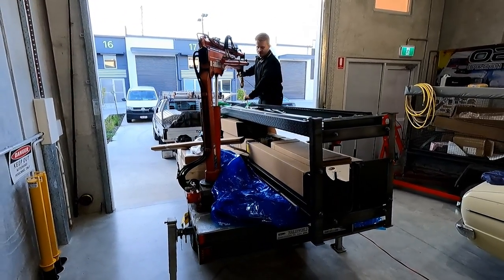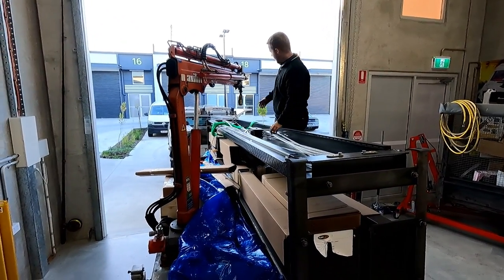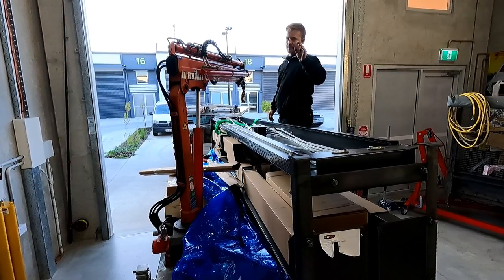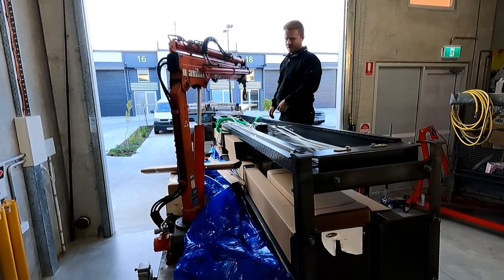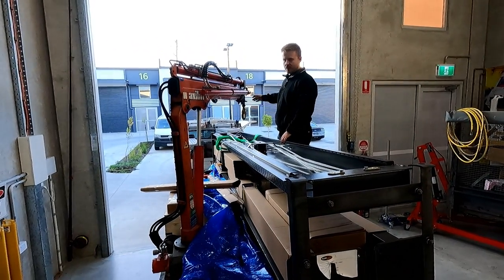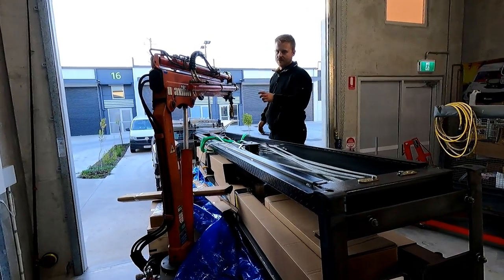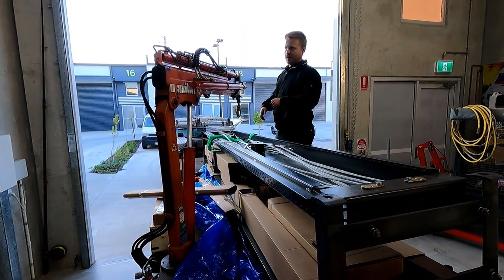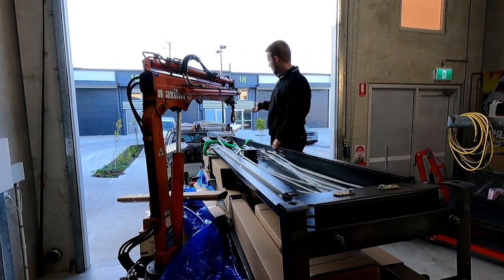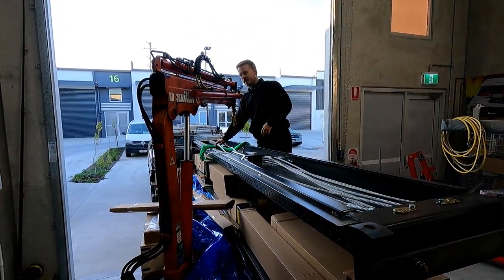All I did now essentially was just pull the ram all the way out so it's closed. Because some people don't do that and then take the hoist up, and then they have to bleed all the air out of it. So I did this so that when the ram's all the way shut, you feel it now, there'll be nothing but oil. There might be a little bit of air left in the hose, which we still have to get at the end, but it's not the massive volume of air. So the little things you do now will help you later.